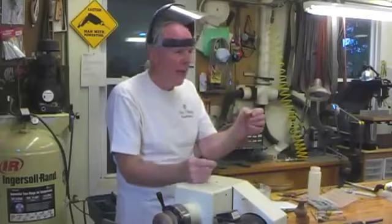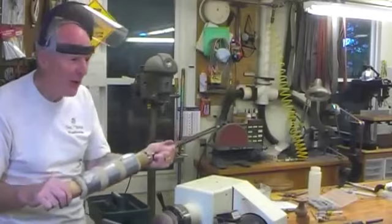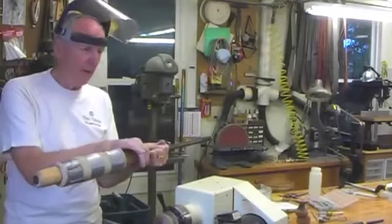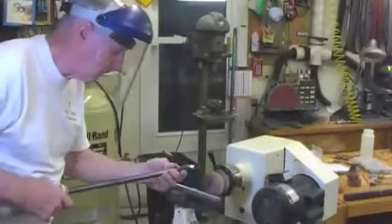And you get pretty good control holding on to this. You make your own handle out of wood. Of course, we're wood turners, right? You just make a curve from a bandsaw. This goes in about three and a half inches, and then cut a thing out here, and you've basically made a collet chuck. Just relieve this, and they come apart. So we'll just start out with a little bit of hollowing, because hollowing is boring.